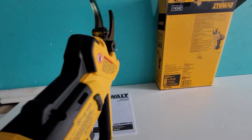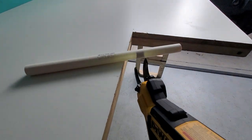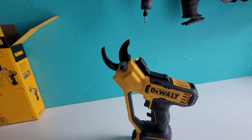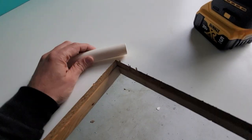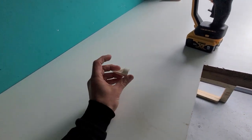I'm going to show the PVC test, though it's a little tricky filming with two hands. Let me hang it over the edge and get a clean cut. My concern was that the pressure would be too high — and sure enough, it splintered quite a bit, a little too aggressive for PVC, maybe from the motion trying to scoop it in. If you keep it still it actually cuts a nice clean cut — the second cut shows that. But on the third attempt it shattered and shot pieces everywhere, so that's no good.